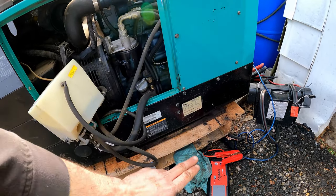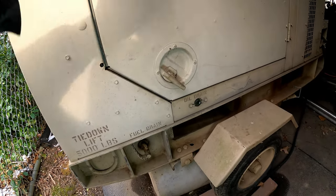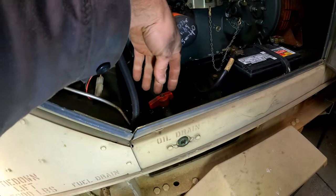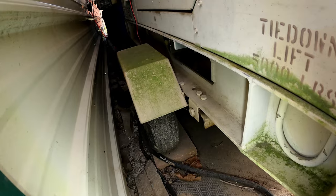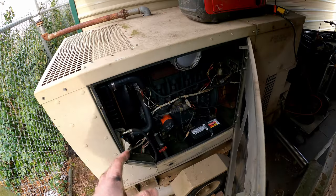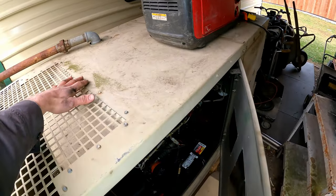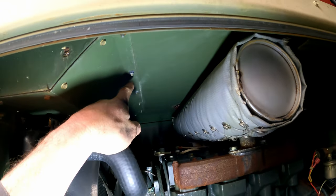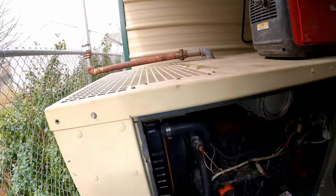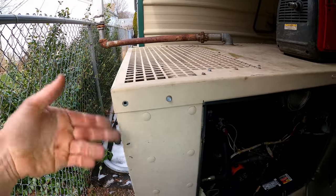It's a little inconvenient to drain the oil — the drain should be on the bottom, so I'll have to lift this up, or pump it out. On the MEP it's super convenient: it's got an oil drain right on the side — just put a little funnel under that. It also has a fuel drain, and on the other side it's even got a coolant drain. Those are pretty convenient. One other big gripe with the MEP: you would think it's easy to take all these covers off, but it's not. There are nuts on the backside of all of these screws. As you go zipping them off, you end up losing the nuts, and what else happens is they rattle apart over time — the thing vibrates, the nut gets lost in there, and the bolt falls out.